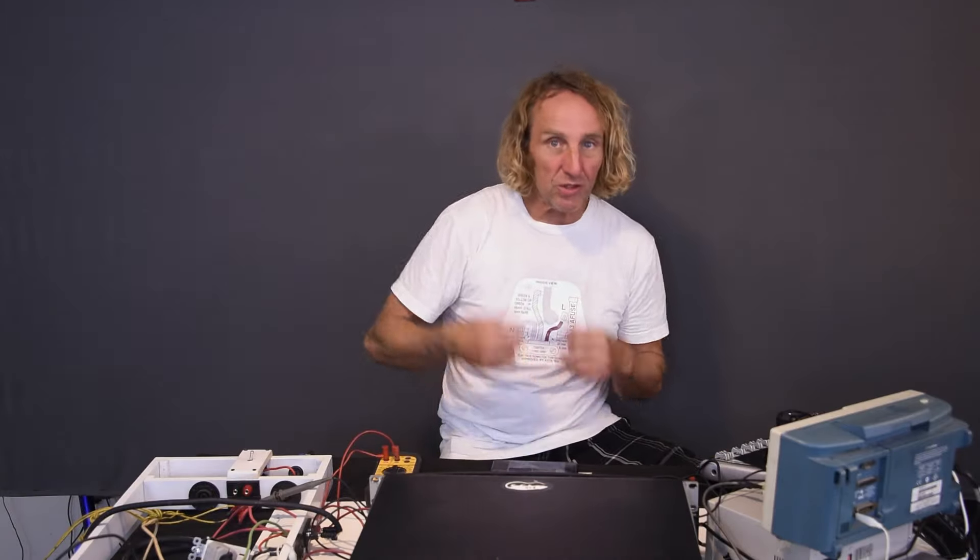We're going to turn up the juice, get it up to 120, and see what happens. We'll also take a look at what happens if you underpower the AC voltage to an amplifier — how important it is to have a solid 120 volts going to the amp, how much power we lose, and whether those power dips matter. I'll also do a little bit with changing the frequency, like dropping it from 60 hertz down to 50 hertz.